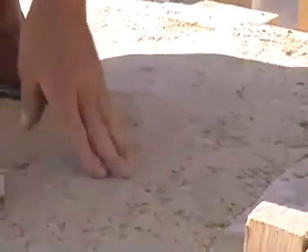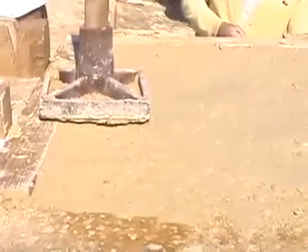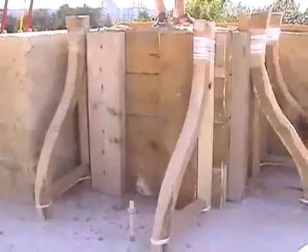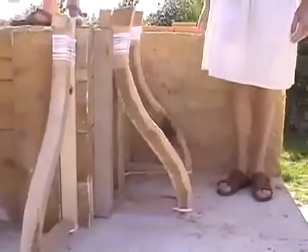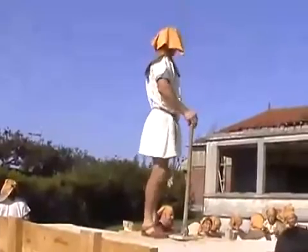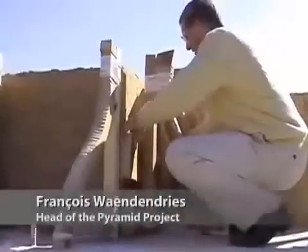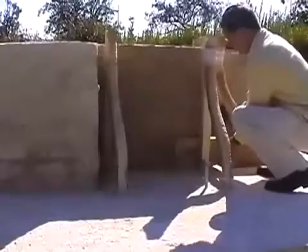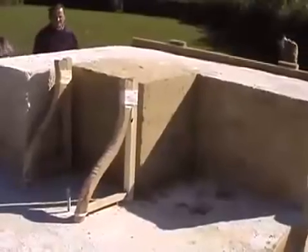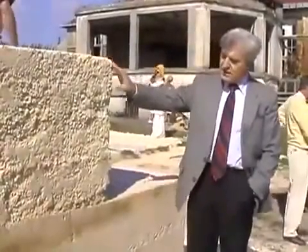When the climate is warm and beautiful, our crew rapidly produces a re-agglomerated limestone that proved strong, dense, and true to the mold's size and shape. The mold consists of small wooden boards which can be reused many times for making other blocks. In this ideal weather, the whole process runs smoothly and is very simple. We remove the mold four hours later. The synthetic limestone looks like a natural stone — we observe no trace of wood grain. Four blocks have already been made.